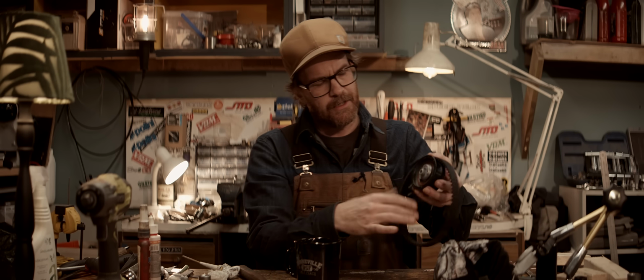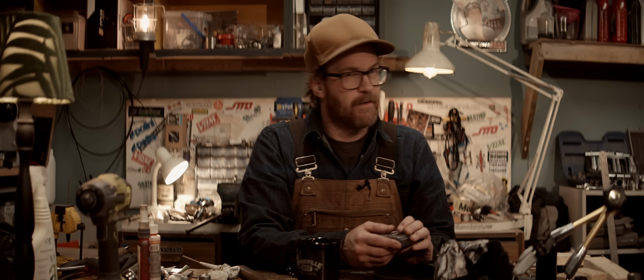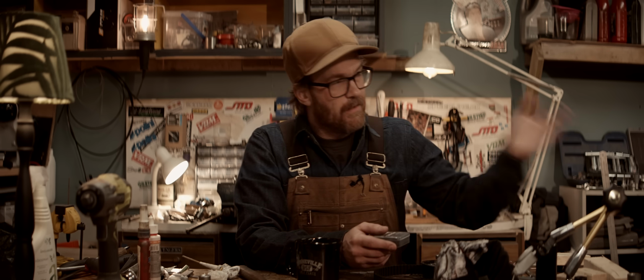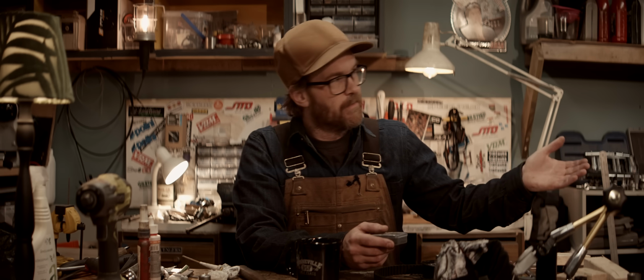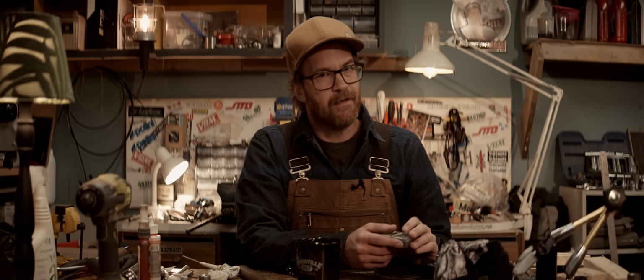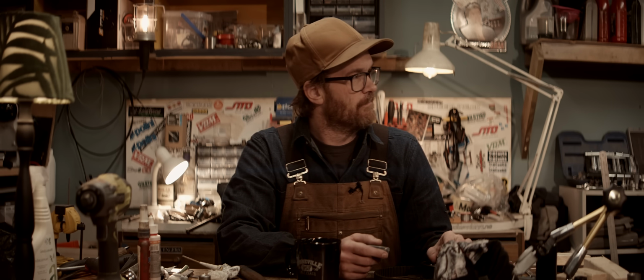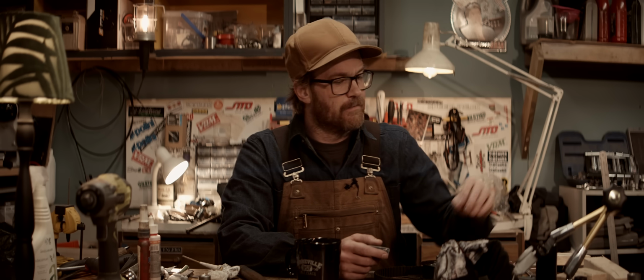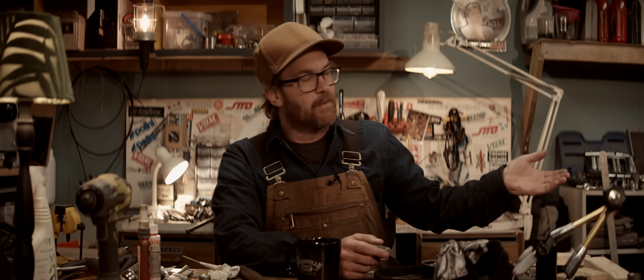I'm gonna hook up the belt and tensioner so that the gearbox is connected. And I'm gonna upjet the carb just a little bit, just to be on the safe side. And we're gonna see how it performs. Today, if it acts as a normal two-stroke should act, and if it seems to be making a normal amount of power, that's it for today, for this Friday. And then we can live in that cloud the whole weekend. Then Monday, hopefully we can start tuning and not troubleshooting. And after getting some numbers from this configuration, start playing with the actual configurations I want to play with.